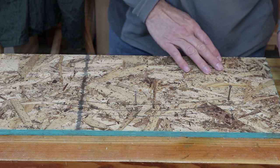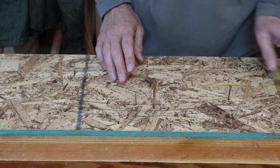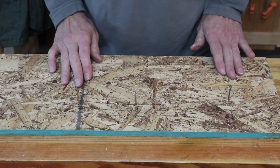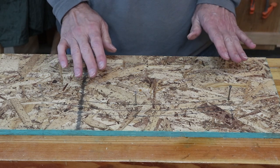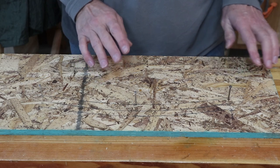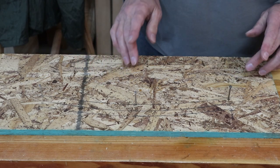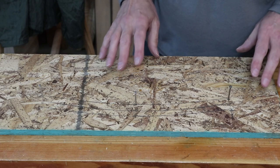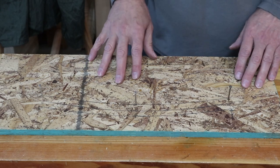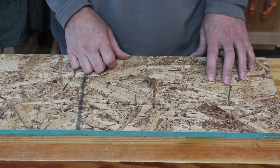The same approach works down here — you can run a guide. The only tricky part is doing the arrowhead and the feathers; you have to be very careful there. My suggestion is to route out the bulk of it and then take a chisel to finish the detail work — pretty easy to do. But since I'm using a pattern, I can use the router for the whole thing. Making a number of these makes it way easier and faster, so let me keep laying this out and then I'll cut it up.